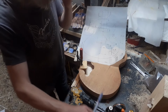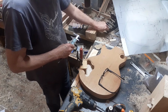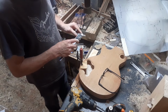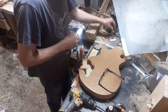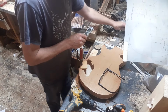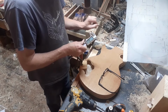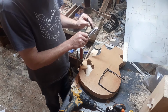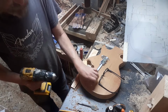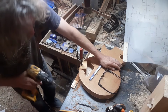So now I can get a quarter inch drill and finish it off. I actually measured the hole at 7 millimeters, but I'm guessing it's a quarter inch hole that's been butchered. That's too much. That's just slightly too big. This possibly could be it. That's a quarter inch. That's actually a quarter inch hole, but it was near a 7. Do you know what, I'm going to drill through with a quarter inch because I'm sure that's what it's meant to be. There we go.